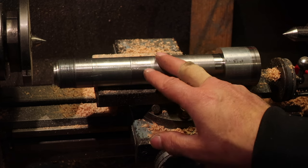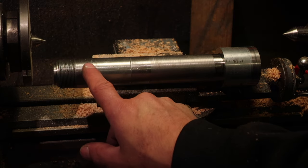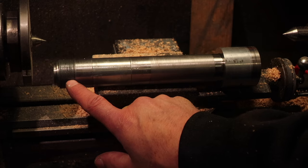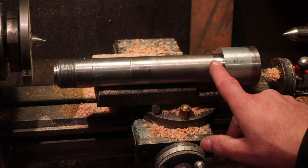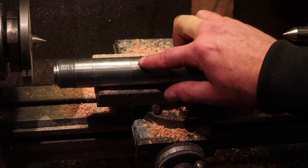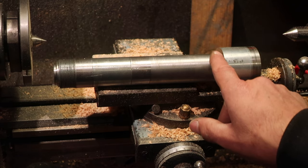So this is the spindle for the mill. I'm stuck with using it because it's got thread and a bearing land here that I need, and I can't cut threads this size on my lathe. I can't cut any threads on my lathe if they're not done with a tap, actually. Tap or die. So what I needed here was a 40mm bearing land, those are 35s, and this whole thing came out, it was much wider here. You see a second bearing land here, it was much wider here. So I cut my 40mm bearing land here,